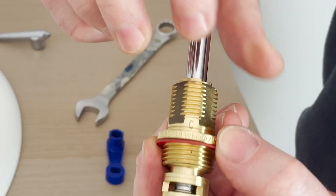We can see we have a half turn, so we'll do a half turn on this one as well. Take the handle off, pop the setting spanner down — that's in the off position. Now move it to the full open position, which is our half turn, and wind the setting screw down, not overly hard, just nice and firm. There's our half turn tap on both sides, ready for testing and the installation of the dress rings, flanges, and handles.